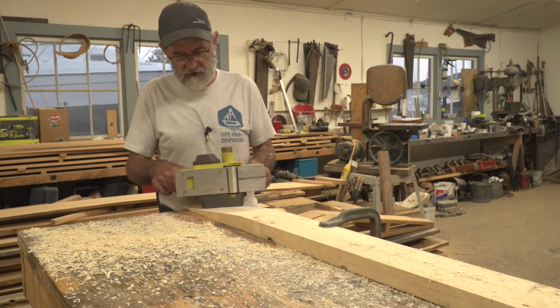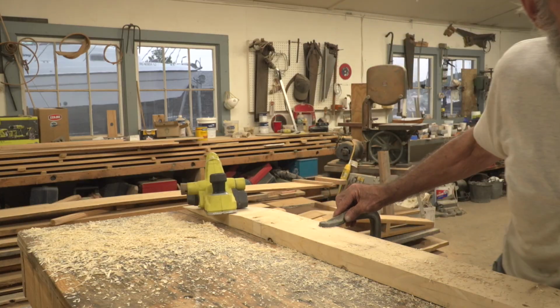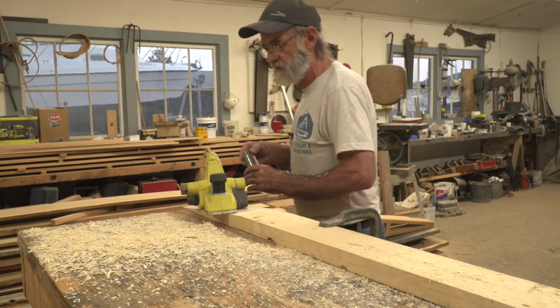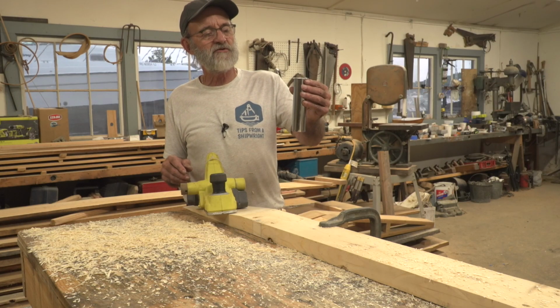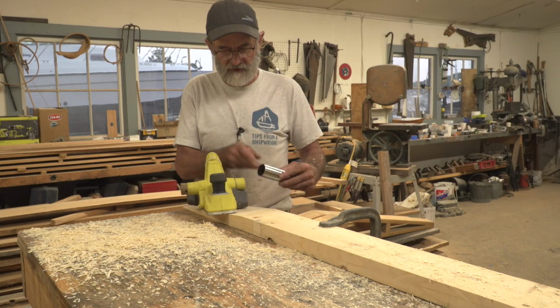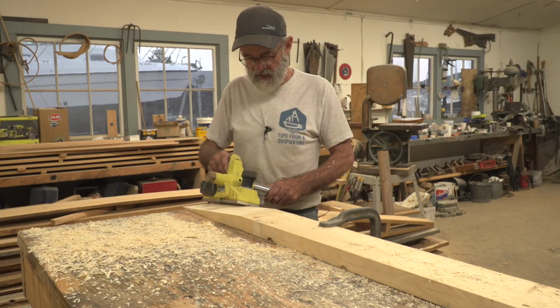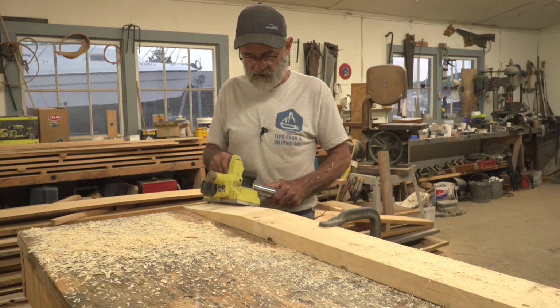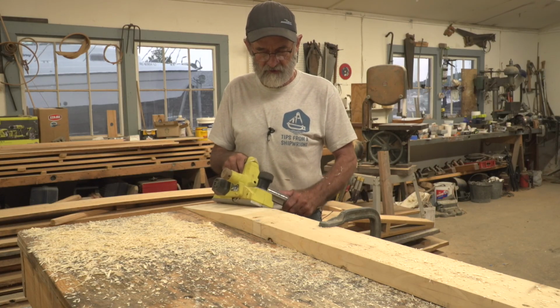So this is my Ryobi power planer. The other thing I'd like to show you really quickly on it is that I took a little piece of sink drain. This is like a little drain from a kitchen sink or even a bathroom sink, I guess. It's the right diameter, and it slips right over the ejection tube like that. And when I'm cutting angles like this, it allows me to maintain the same angle as long as I keep this hand in the right spot.